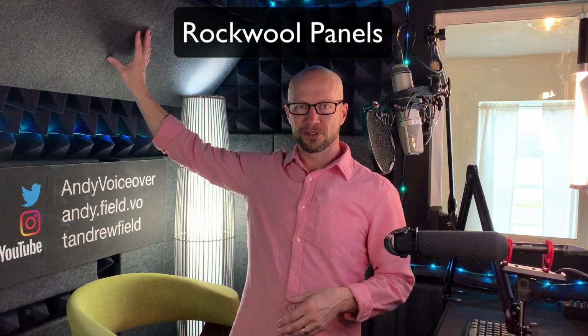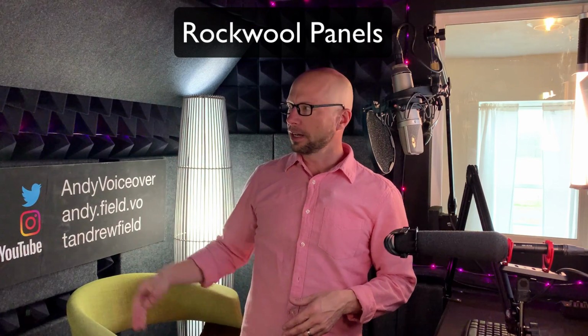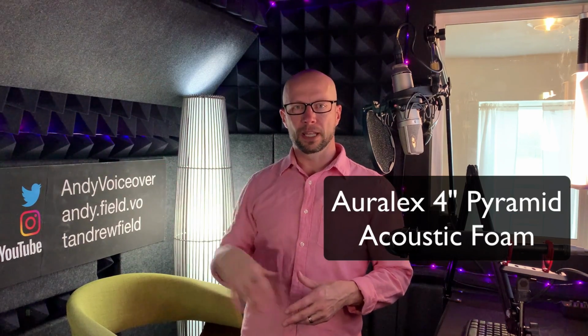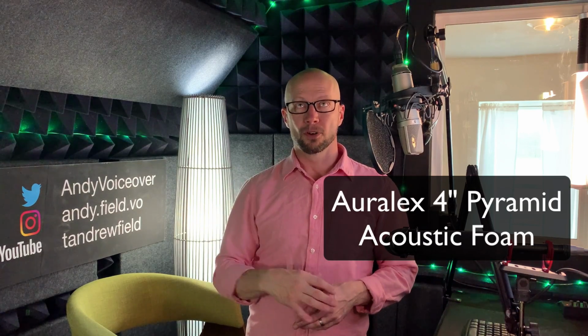This is the inside of the booth. These are Rockwool Safe and Sound acoustic panels, and in between those is Auralex acoustic foam. Most of the foam in here is 4-inch pyramid foam, and that's covering the ceiling and all 4 walls, and then just a rug on the floor.